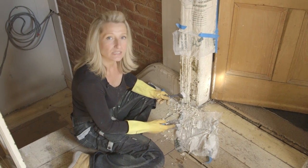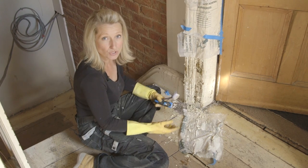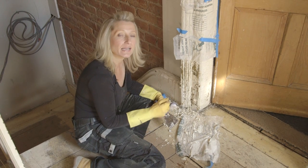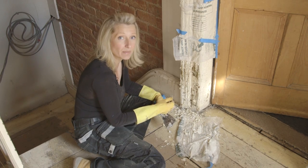It's a really good idea to do a test section first. What you would do at home is do a test section, leave it on, and then you can work out exactly how long the peel away will take to work into your paint and your piece of timber.